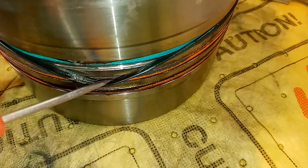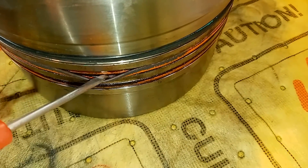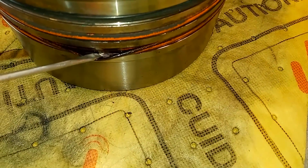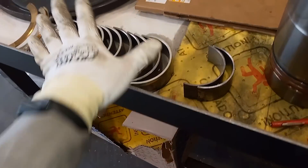What's interesting is the liner seals here are not O-rings. They're actually a flat half-moon-type seal, similar to what a C12 or a C13 has. But on the C15s, they're just big old fat O-rings. These are flat ones, and that is because the liner is so much thinner — I don't believe the O-rings would even fit.